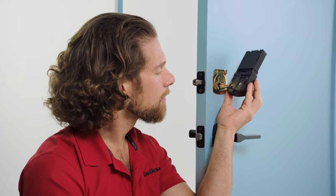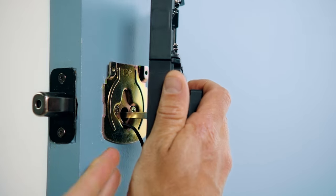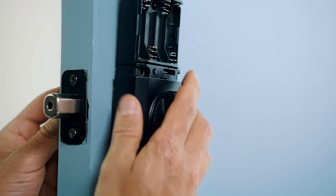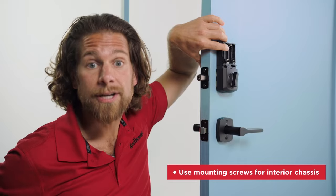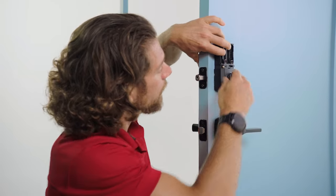Nice — that's smart, isn't it? Some engineer got a raise for thinking of this, or a nod of approval from Mr. or Mrs. Kwikset. At this point, you'll see that the flat blade piece can be inserted into the turn piece to complete the interior assembly. Using two mounting screws, attach the interior to the mounting plate that you secured earlier.